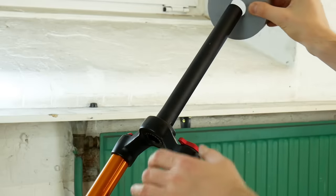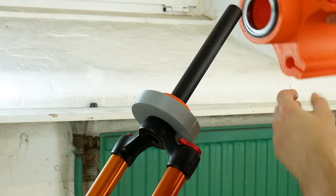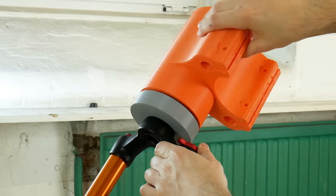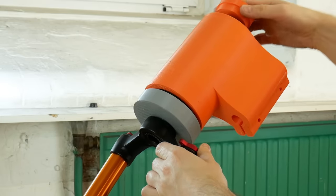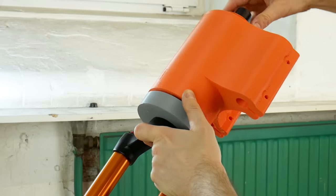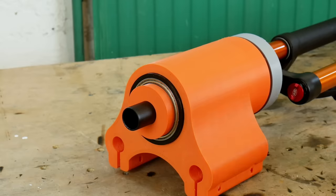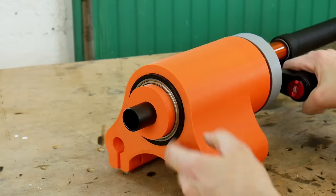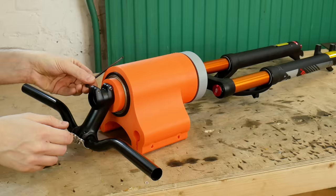And now we've got all the parts, those slot onto the forks. So those two pieces slot on the bottom, and then the main steering column fits on and it's resting on the thrust bearing and also is constrained to the main fork upright there, the steering stem, by those other bearings that hold it in the middle. So obviously a bearing top and bottom fitted into the main steering column and neatly fitted with those collars on the stem.